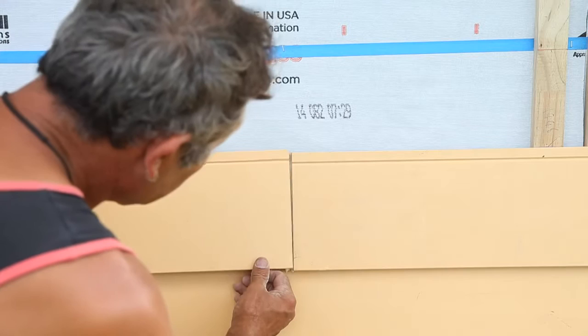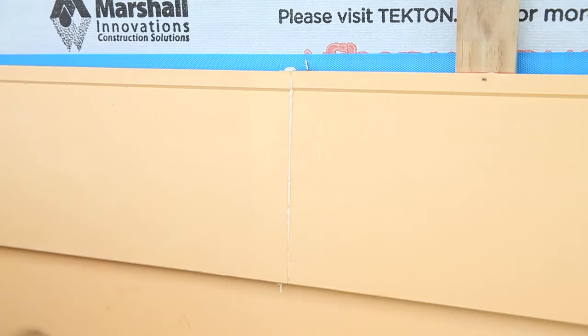Woodlock, weatherboards and fascia can be joined anywhere along the wall, on and off stud. Take the new board and lock in place. Press hard to squeeze out the excess glue. Pin the joint in place with 4 brad nails.